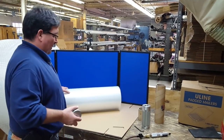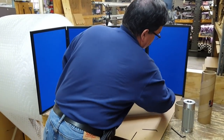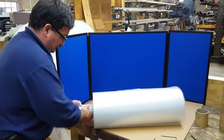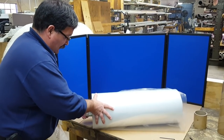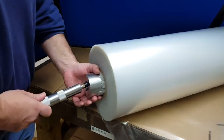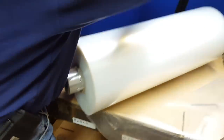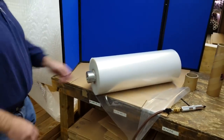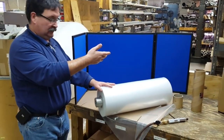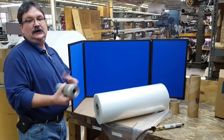As an example, if you have a much longer roll of material, you can insert the end plug into one end and the air chuck slides easily into the other end. You take your inflating gun and inflate it — now it's locked inside. That roll is locked to the air chuck, and the end plug supports it on the other side. To take the roll off, you simply deflate the chuck and it slides right out.